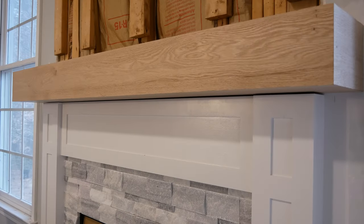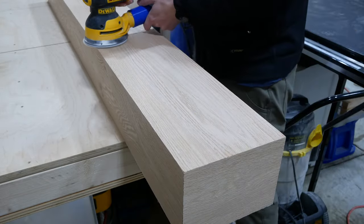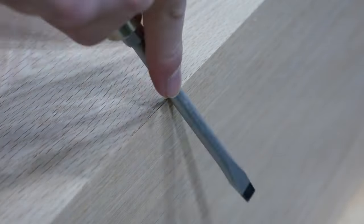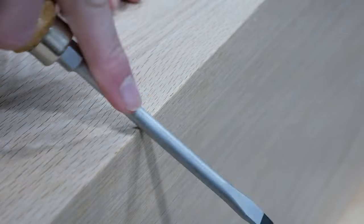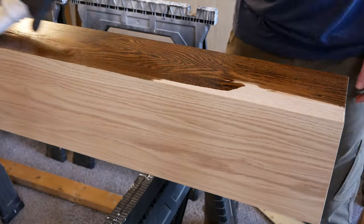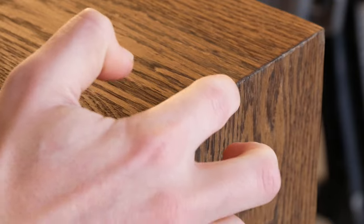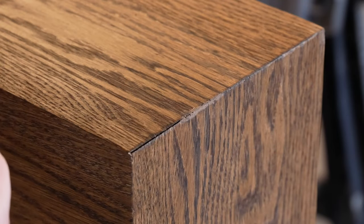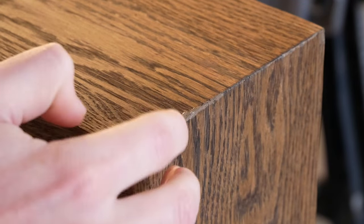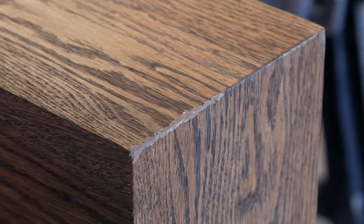To finish the beam, I first sanded all of the flat surfaces with 220 grit on my orbital sander and then used the rounded edge of a screwdriver shaft to round over the seams. Doing this closes the small gaps by forcing the wood fibers of the two board edges together. After this, I hand sanded all the corners to smooth them out and then removed the sanding dust from the beam with an old paintbrush. I applied a coat of stain in the direction of the grain and a few minutes after applying, wiped it down to remove any excess stain. After letting the stain dry overnight, I looked to fix the larger gaps that couldn't be closed using the screwdriver trick. Rather than wood filler before staining — which gets into the grain and does not stain very well — I applied a color-matched wood filler and while still wet, wiped off the excess with a damp cloth.